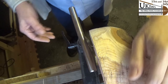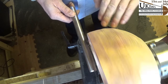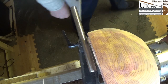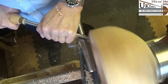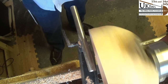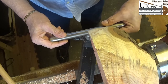I've got rid of the bowl saver and it's all set up now. You can see the gap here — and then you get over there and there's hardly any gap — there's a heck of a warp on this thing. So the first thing to do is try and get rid of it: get the tool rest as close as I can and try and level this off. Should be fun. Level-wise we're just about there but it's still way out of shape, so there's a lot of work to do to bring it back to somewhere near round.